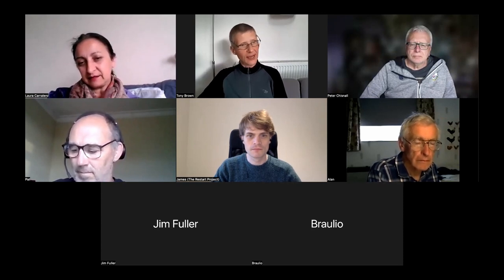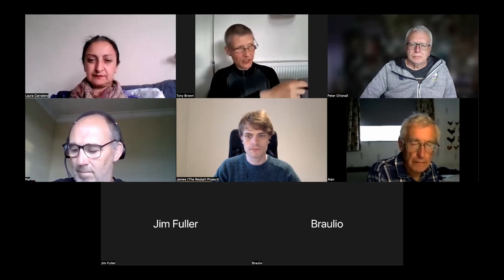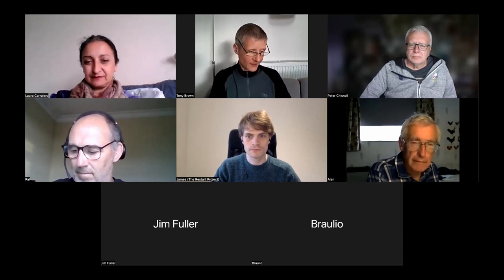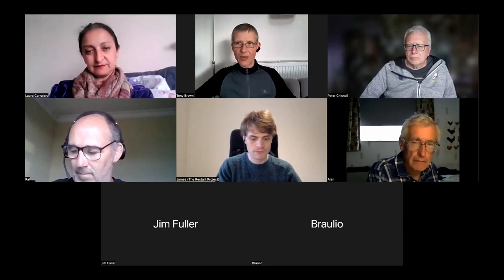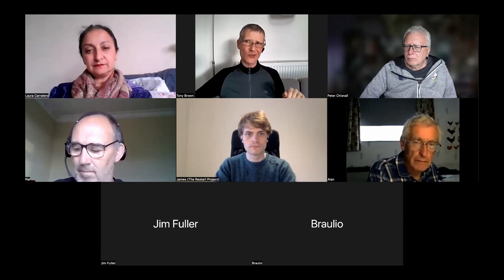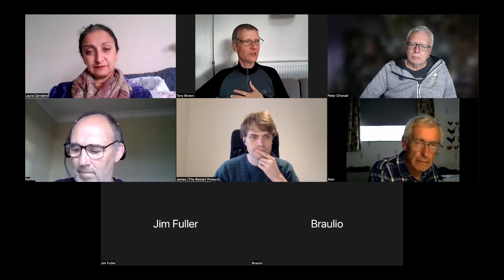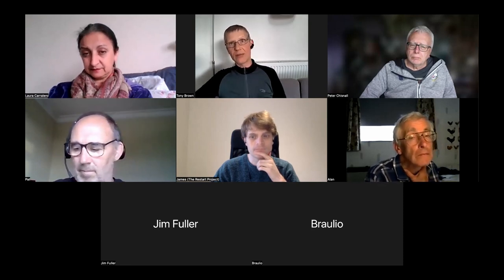When you look at certainly smart TVs like this Bush one. By the way, this Bush is largely an empty box, right? And if you're having difficulty trying to find the parts for these really cheap TVs like Bush and Alba, they're actually based on components from a company called Vestel, V-E-S-T-E-L. So that can be the place to go to find the manuals. But to answer your question, Laura, the smart TVs will often have, you know, they're basically a computer, right? So they've got RAM, and RAM is static sensitive.